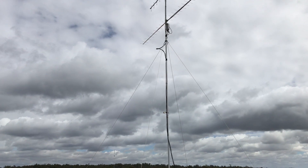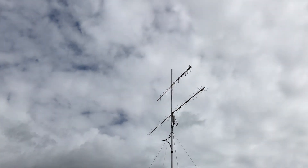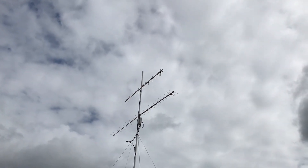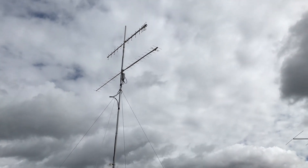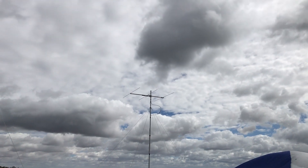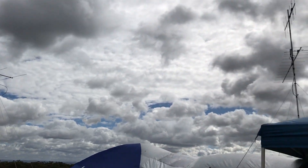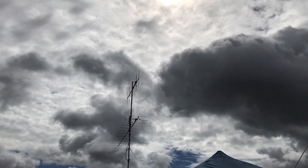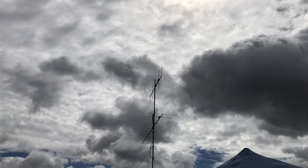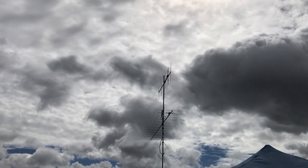Up this way we have our 70cm mast. I can't count how many elements there are — probably 15 or something horizontal, a little bit less on the vertical side, and a masthead preamplifier. Over on 6 metres, there's a 3-element Yagi — we don't use a preamp there, not yet anyhow, but we should. A conventional rotator, not using the compass. And lastly up there on 2 metres, 13 elements or whatever it is — horizontal — and you can see the compass is a little lower on this one. And 1, 2, 3, 4, 5, 6 elements or so vertically polarised.